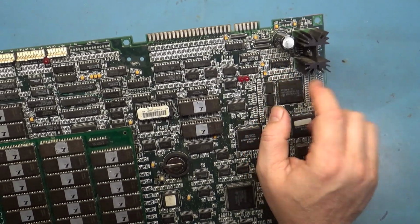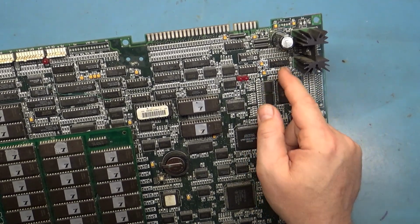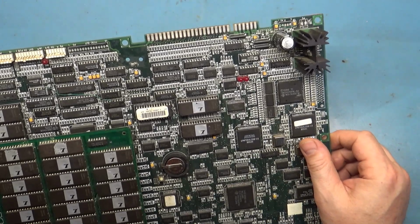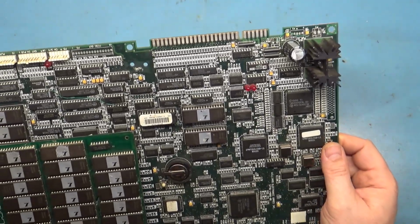Likely just needs replaced. The TL084CN. This op amp likely just needs changed out, but the audio works fine for now. It's a little scratchy, but otherwise it works fine, so I'm not going to mess with it until it goes out completely or it really needs repaired.